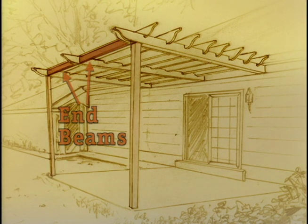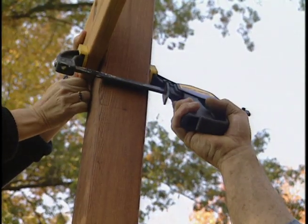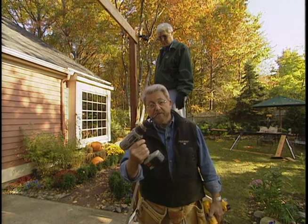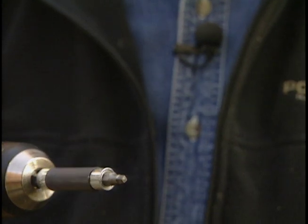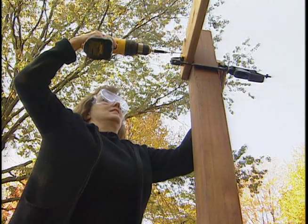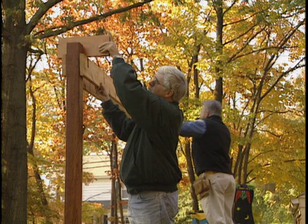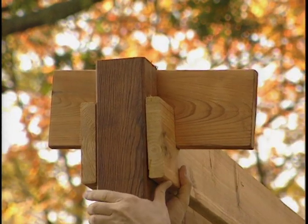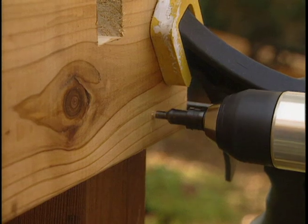With the post secure, our next job is to install the two end beams. The bottom of the board on the line. We use adjustable clamps to temporarily hold these in place. To attach these beams to the post, we're going to be using two tools: a cordless drill with a countersink drill bit, and a second cordless drill with a screwdriver bit holder. This has got a square bit because that's going to match up with the square drive hole in the end of this stainless steel screw. Stainless steel screws are non-corrosive, which makes them a great choice for outdoor projects. Now for the inside end beam — just drop that short piece of wood in to make sure the notches are aligned.